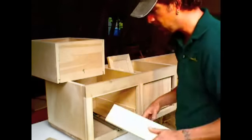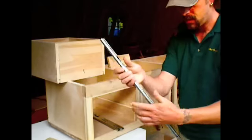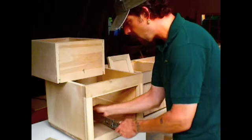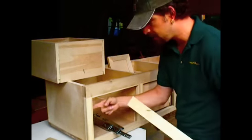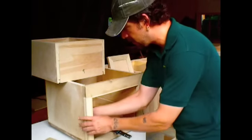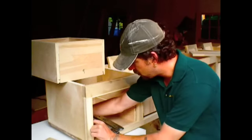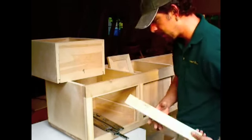I've cut a couple of spacer blocks. These spacer blocks go on each side of the cabinet. These are full extension, 100-pound slides. The space between the cabinet and the stile is half inch on one side and nine-sixteenths on the other — don't ask, it just happened that way. So we'll put the half inch spacer in there, and it'll give enough room so that the block sits proud of that. Do the same thing on the other side.